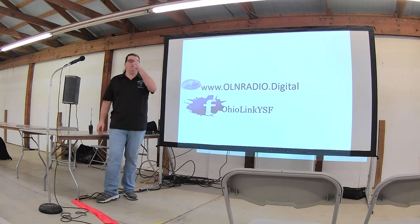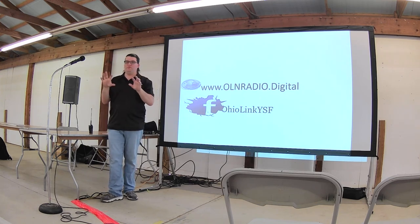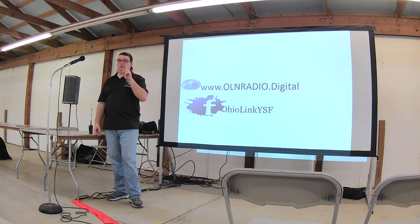Oh, that was something else I was going to bring up. When you're talking on the radio, the ones that have Fusions may know this, when you get into the digital realm, there's three modes. Technically more than that, but voice wide, which is VW, and digital narrow, DN, are the two primaries. The reason I'm putting this out there is because when you're starting to talk about digital connecting, especially in our network, you have to be in digital narrow for everybody to hear you.